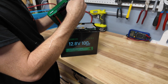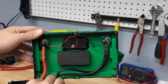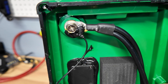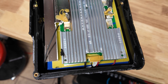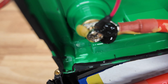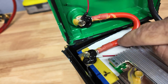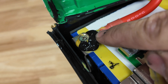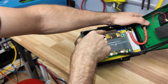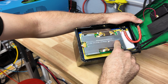This was by far one of the hardest batteries to open. Right under the cover you can see where they connected the little voltage display — wires connected here and here with pretty nice terminals. You get two 8-gauge wires for the negative going down to the BMS, which is right on top — that makes sense because I felt some heat coming from there when we were pulling 190 amps. On the positive side it's very nicely secured with some sealant applied, and you get a 6-gauge wire connected directly to the positive terminal. There's a giant bus bar coming from the cells to the BMS — very robust, that'll handle a lot of current.